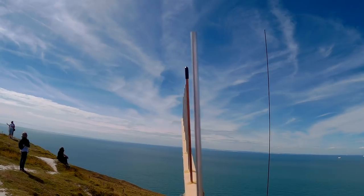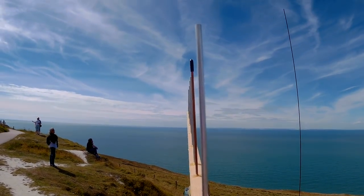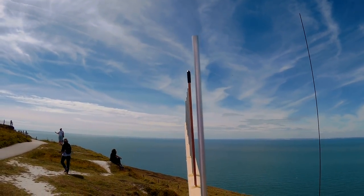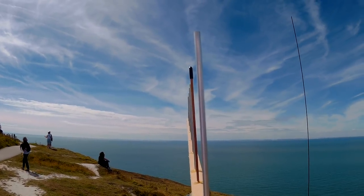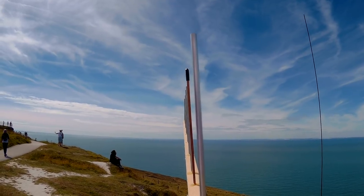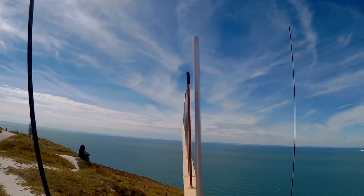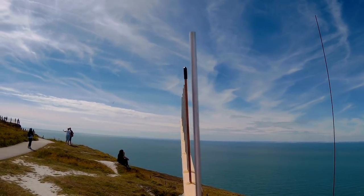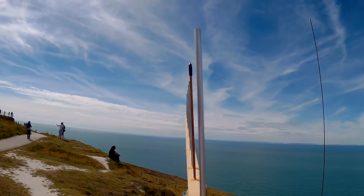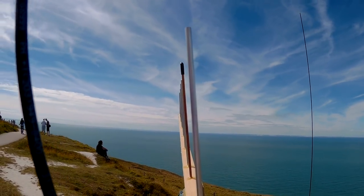Just a quick comment. I'm just building a 6 meter repeater which will be located at the same site as this current repeater that you're talking through. I'll email you the details, and maybe for the future you could also try that, over. Yeah, thank you very much. I think I did find it, but the problem was that my PRC351 has 25 kilohertz steps, and I think the repeater doesn't fall on those frequencies, so that was the issue. Otherwise, I definitely would have tried. Over.